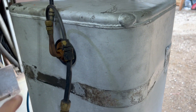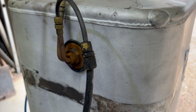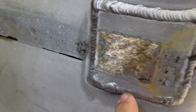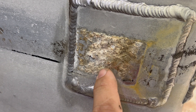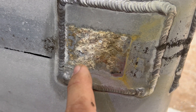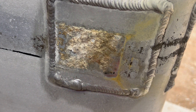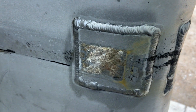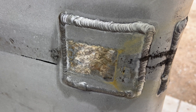There's a diesel fuel tank repair here. The customer wants a component removed and there's some diesel fuel in it with some additives. There are some old repairs that are no good anymore. I'll show you how to clean all this. We had to wash this tank with hot water and Dawn soap, which was messy. Normally on diesel fuel tanks we just purge them with argon and weld, but on this one we had to go the whole nine yards.